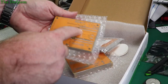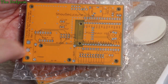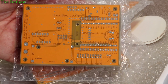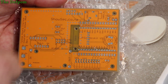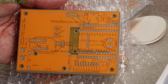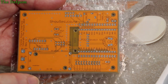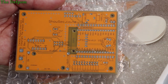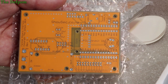We'll see if I've got it right. So it's got an ESP32 module on there, a power supply, and it's got a header here for the FTDI. So that's the power supply — module goes in there. FTDI adapter, so if I need to program the LoRa module I can just plug it in and allow me to plug it in circuit. I've got a header here — I could have used switches but I decided to use headers with jumper pins. So what I'll do is take the pins off and stick it on to the next pins over, allowing me to put it into programming mode to program the LoRa module if I need to change any configuration. It will also allow me to isolate the serial connection from the ESP32. Hopefully I haven't made any mistakes — I've been rushing so much trying to get all this project done, but I'm hoping I've got it right.